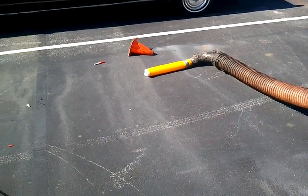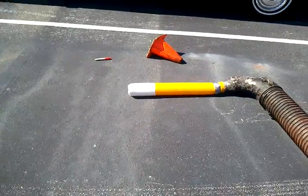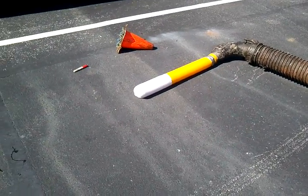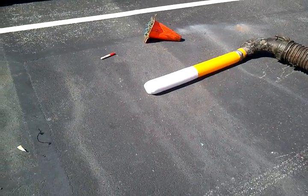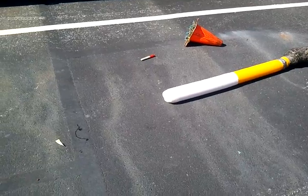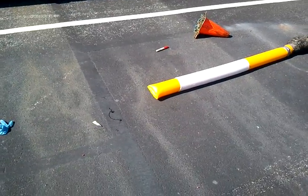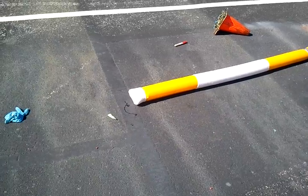Then here comes the lining — it inverted, and as he adds more air it keeps inverting. So now we're in the cast iron pipe that we're trying to line, and then we're going to get to a fitting. There's a service connection in this cast iron pipe which is going to be unlined — about a 12 inch section — and then it'll be followed by liner again. There's the liner.